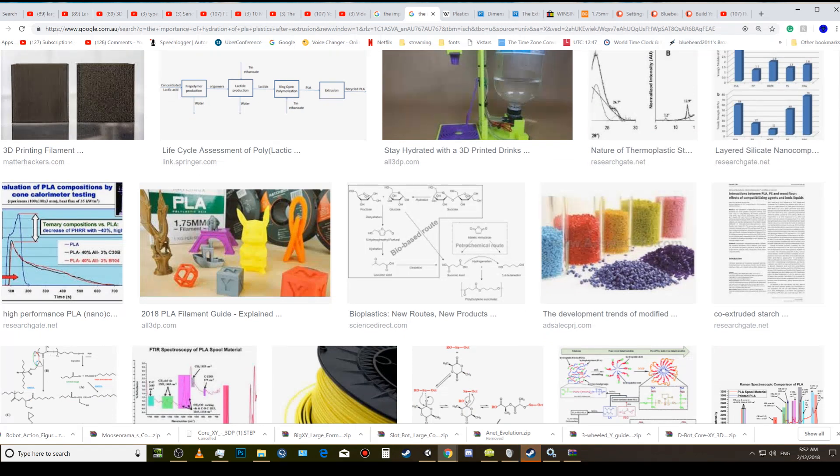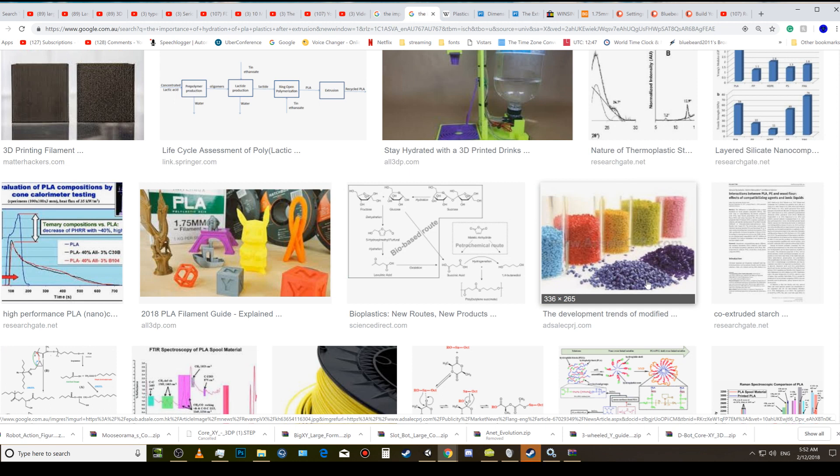Prior to extrusion you must keep the filament dry, because what we use in the factory is essentially the same plastic as 3D printer filament — it's as if it's been through a plastic extruder to make the roll, then chopped into little pellets. So we're using the exact same plastic, just chopped up, which we put into our extruder and push into a mold. All we're doing is extruding and pushing into a mold, which gives a much better seal because we're adding pressure to the joining of the plastic.